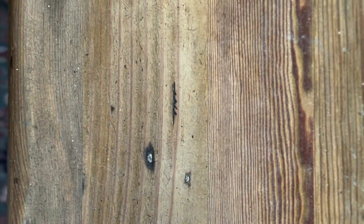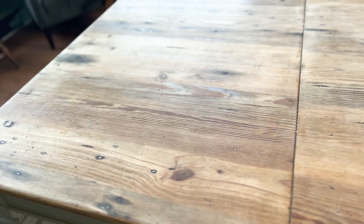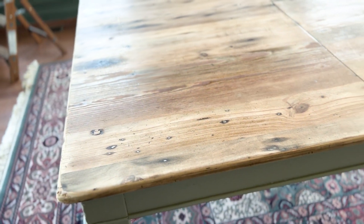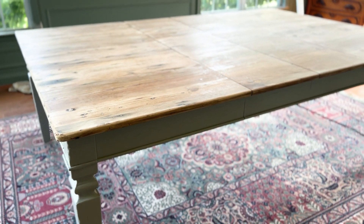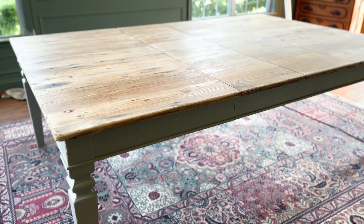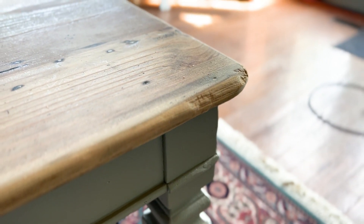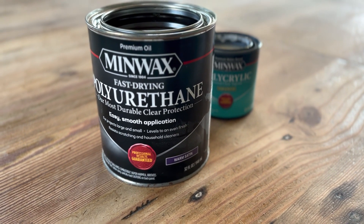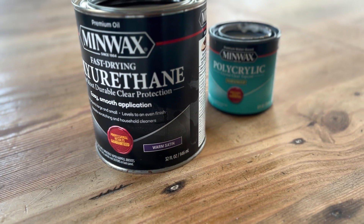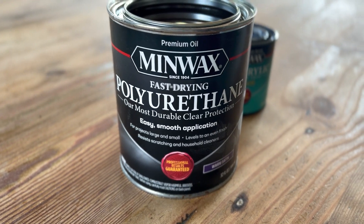The tabletop also needed to be sanded back so I could fix the corners the puppy had chewed. I simply sanded off the polycrylic that had been on there from years earlier and rounded the edges as best I could. Not all of them could be done perfectly, but where it couldn't, I smoothed it as best I could — and it looks a little antique, which is perfect for the theme of the room. Instead of going back with polycrylic as I did the first time, I'm going with an oil-based poly. I think it will be stronger, better suited for how we use this table, and it'll add a touch of warmth to the wood top since I won't be staining it.